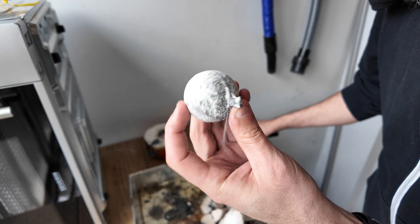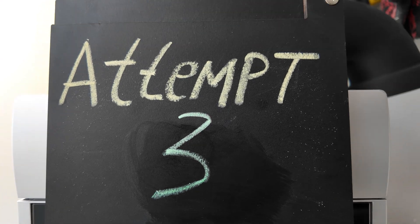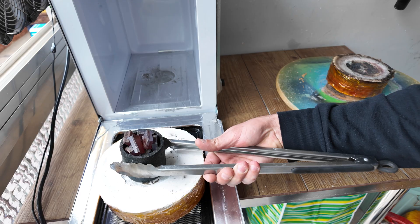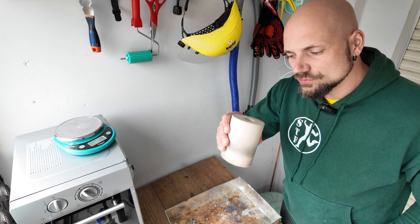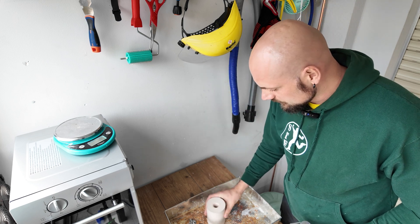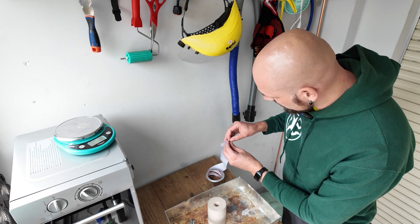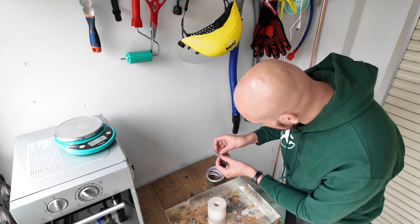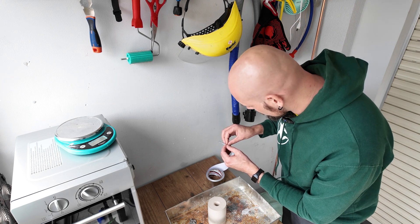Instead of a wrecking ball I made an iron pokeball. I made another mold — this time a little bit thicker. It's an 80 millimeter mold instead of 75, and I also wrapped it with aluminum tape. It can help to hold the mold together if it cracks. Aluminum can obviously withstand high temperatures but the adhesive can catch fire — just so you know, it will burn.